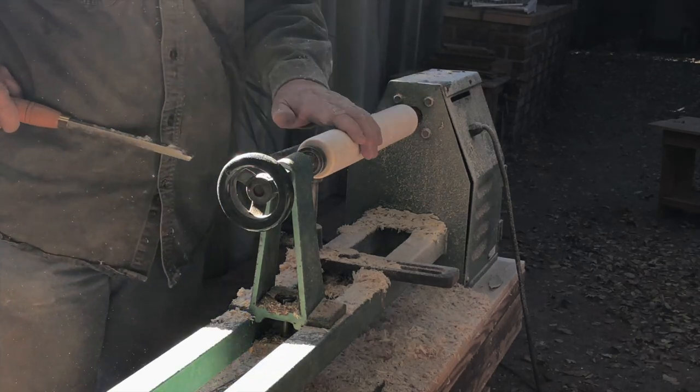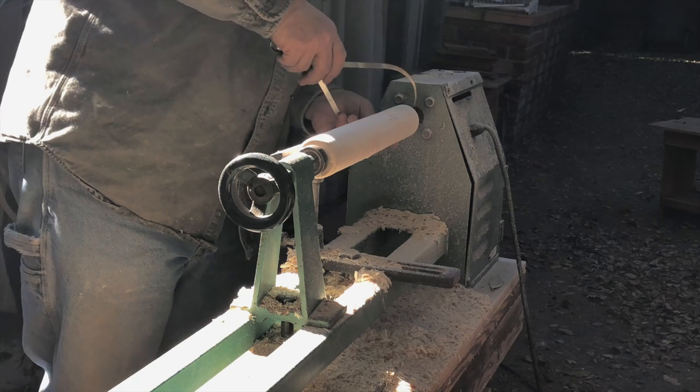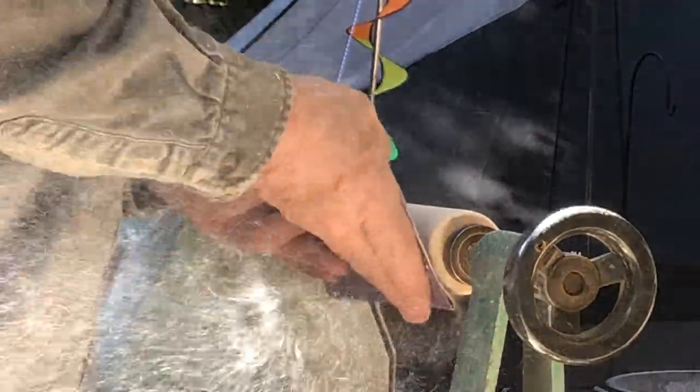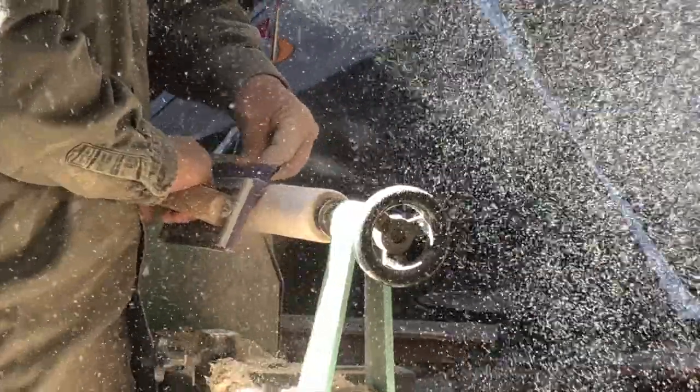Cutting a very symmetrical roller may be more difficult than other shapes you can think of because it has to be level and smooth across the entire width. This is just a roller stand to feed wood and it's not going to be a high-speed roller, so little imperfections won't show. You may not like sanding, but at least for the first few times when you use a lathe to sand a spindle, you're going to enjoy it. It's effortless and painless, and depending on the grit of the sandpaper that you use, that abrasive can be a very effective carving tool and you can remove a lot of wood quickly. At the end, I'll use a flat-surfaced sanding pad to help me get a straight edge across the width of this roller.